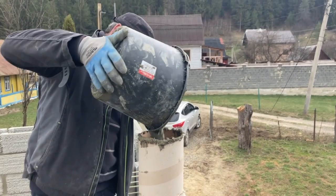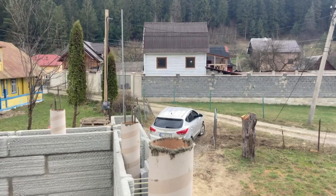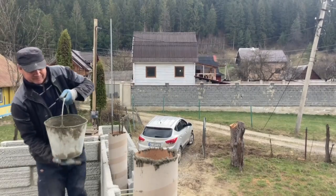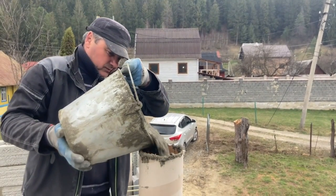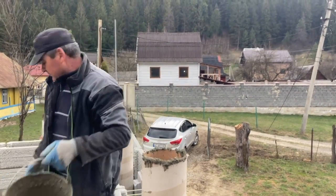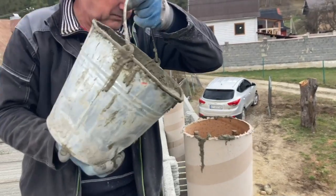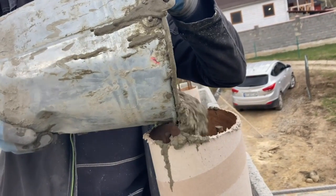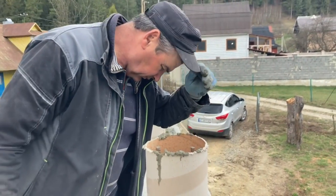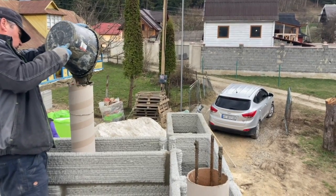This creates what's known in the industry as an RC, or reinforced column. It's a very commonly used structural element and it's very easy for engineers to calculate exactly what kind of structural integrity it has — as opposed to 3D printed concrete, where the mix can change layer to layer and the structural calculations can be very challenging to certify. One day I hope some material or process can be certified that eliminates the need for this manually inserted rebar or columns, but for now this is the best way to go about it, especially because it generally doesn't require any special permitting beyond current standards.